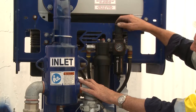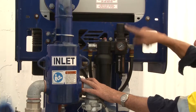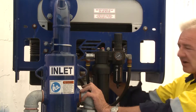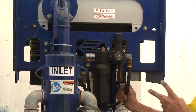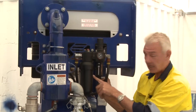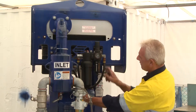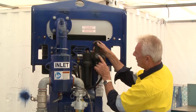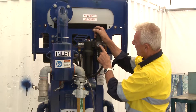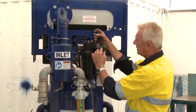The regulator says here in big letters: do not exceed 60 PSI on air motor. This regulator controls the air and the rotational speed of the pneumatic motor underneath. The pneumatic motor has two bearings and two seals, top and bottom, so they need lubrication. The air motor needs 60 PSI, so screw the regulator knob down until you reach 60 PSI — don't exceed it because the bearings can't cope with the speed.